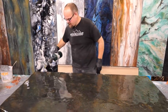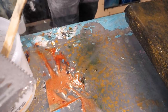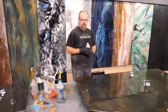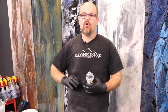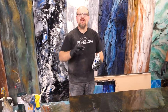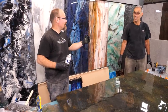After chopping the surface, torch the bubbles out and then you're ready to apply the effects. The key with this process is not to overdo the metallics — spray the spray paint, hit it with the metallics, and wait a few minutes before you judge it. If you overdo it, you'll apply too much alcohol to the surface — it'll look cool for a little bit and then it'll kind of flow back together, reducing the enhanced effects. Try this on a sample board before you go for it on your whole kitchen.